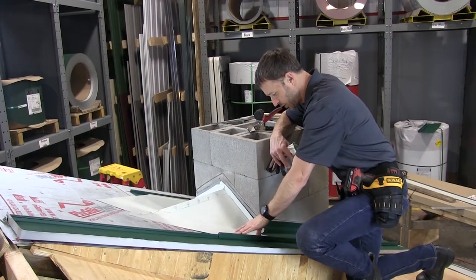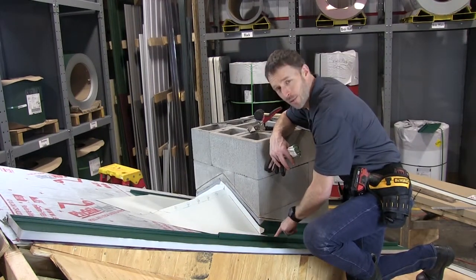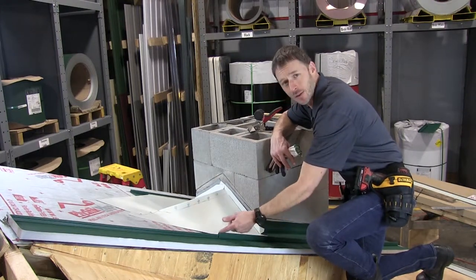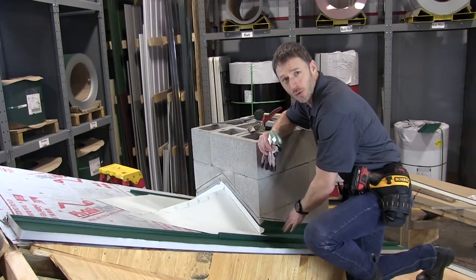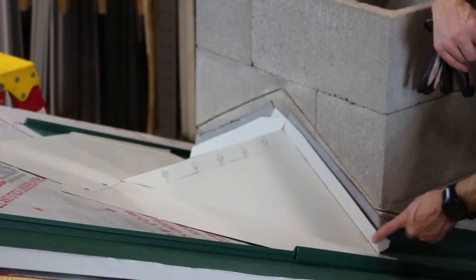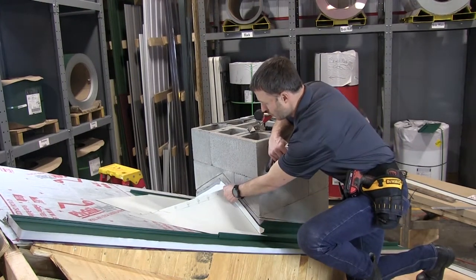The next panel will come over, lock down, and push this. We haven't used any sealant beneath the hem here because we don't want to trap any water that potentially gets underneath the valley — we don't want to trap that water at the corner, we want it to flow out from underneath the valley pan and down the roof. But we have used sealant in between the various layers of steel, especially at the corner of any of the joins.